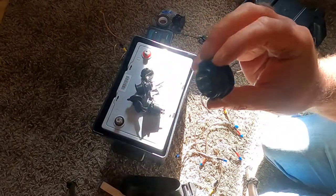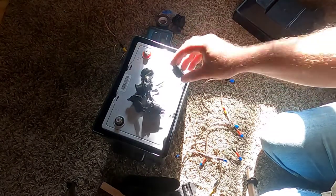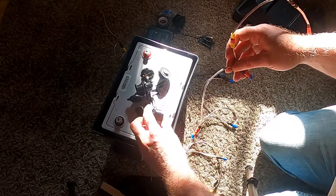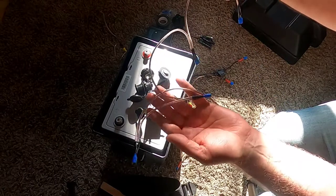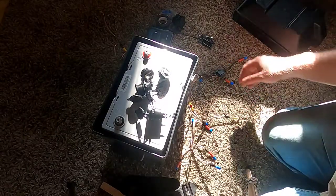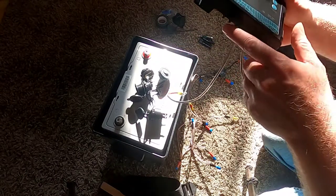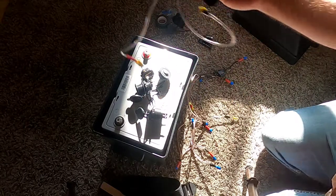There's a three-prong DC connection I'll walk through how to install. To save time, I put together some simple wire connectors — little terminals that hook into the different components. I've wired the positive string and the negative string. I've also got a PWM solar charge controller with two wires connected to the battery terminals, and two more wires I need to build out with MC4 connectors that'll feed out to plug in solar panels.